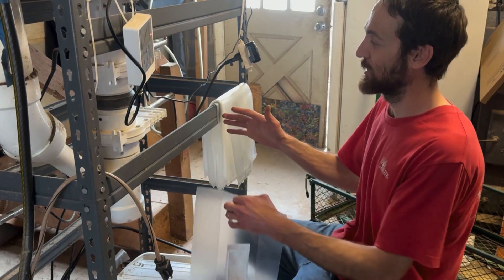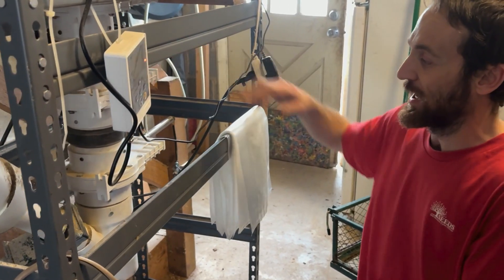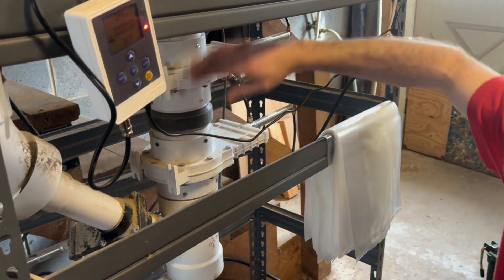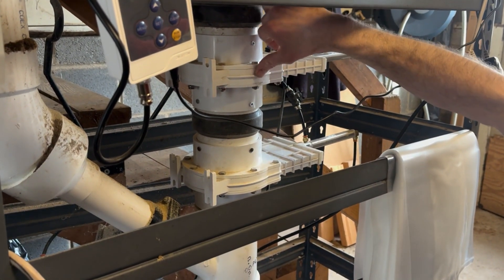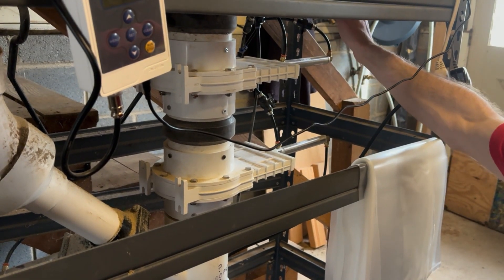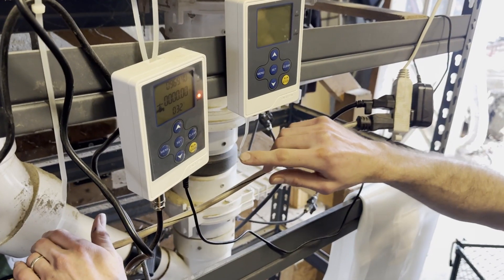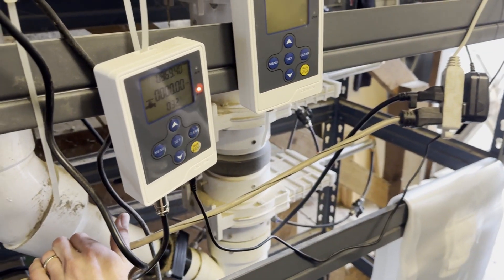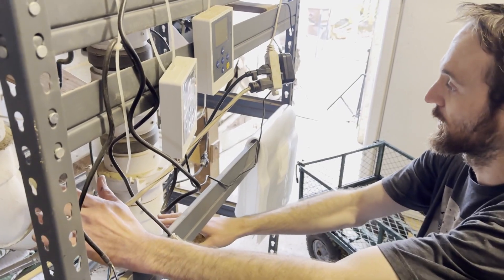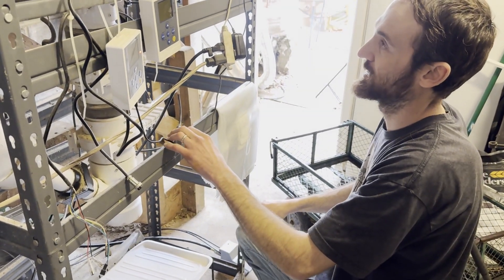One of the modifications we made is we have a four-inch pipe used for the paddle bits, and we added a second paddle bit in the middle — or a third paddle bit — but this cut our ten-pound bag into half to make five-pound bags, so that we could seamlessly transition between five and ten-pound bags. We just have ball valves on the air lines to turn them on and off. On the water side over here on the left, we have a controller that measures out the right amount of water and dispenses it into the top of the pipe, held ready in a reservoir for the drop, so the pellets and the water drop at the same time.